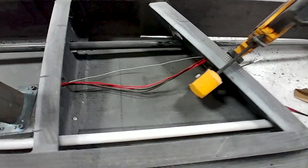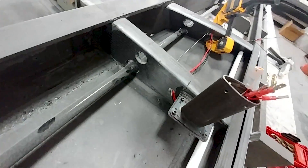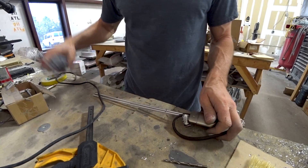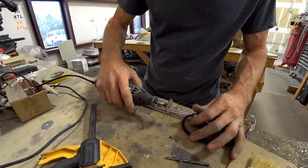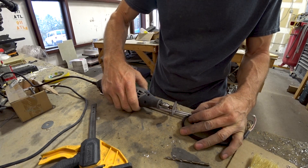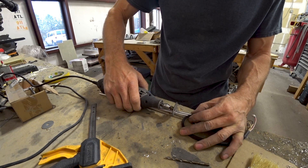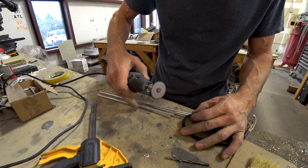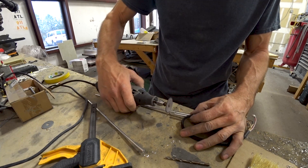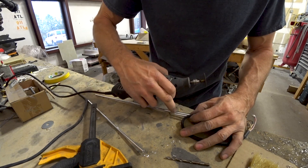I've moved over onto the foreplane and starting to get some things sorted out with the pitot tube. I've got the heater box installed and just being bonded into place. Here's the pitot tube itself — I'm just going to use the Dremel and trim off these aluminum tubes, one for the actual pitot and the other for angle of attack. Both of those run the air pressure back to the GSU 25 back in the cabin — one gives airspeed and the other gives angle of attack. I'm just trimming those off with the Dremel.